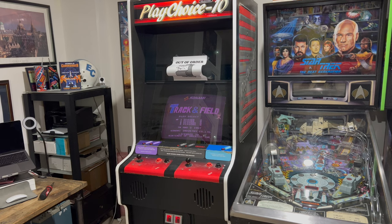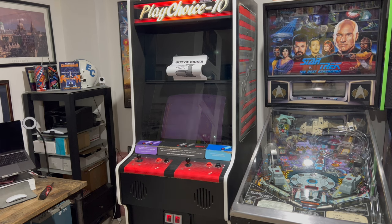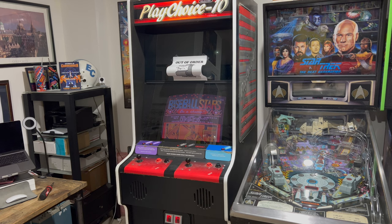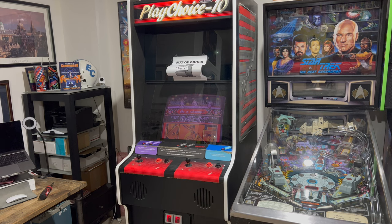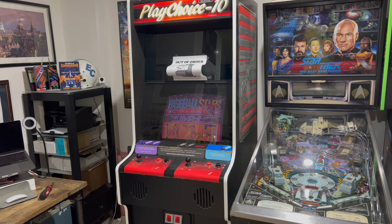The way this game works, the gameplay is actually in the lower monitor. The top monitor has the menus for selecting the different games and has instructions on how to play. I replaced the flyback on the top one before, and what happened was I accidentally left this on for about 48 hours. When I came back the top monitor was glitching out. Turned it off, let it cool down, turned it back on and immediately heard a pop and smelled burning plastic — a characteristic sign of blowing a flyback. So we'll try replacing the flyback on that one. But first, let's get these monitors out of the cabinet.